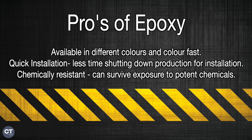Epoxy also has this issue when it comes to heat. It doesn't handle heat very well. It also doesn't handle thermal shock very well. So especially when you're in a situation where you need to clean floors by steam cleaning it and so forth, epoxy is not the greatest product for that. However, it is a great product to take abrasion. So a lot of traffic over it, fine, it's a stunning product. The other thing that it's nice with is it retains its color over time.